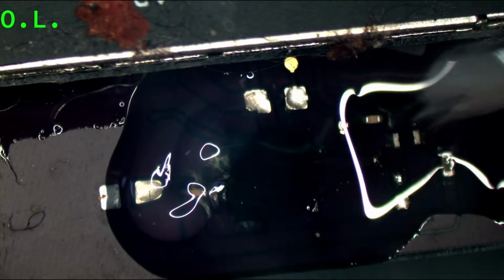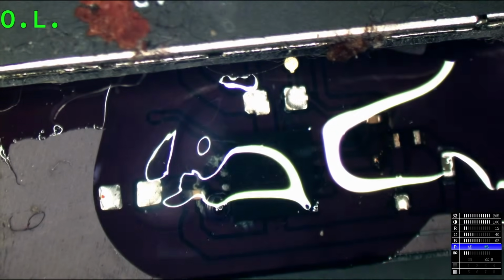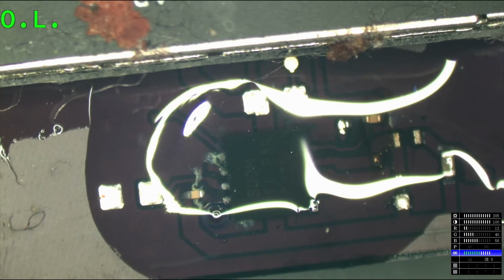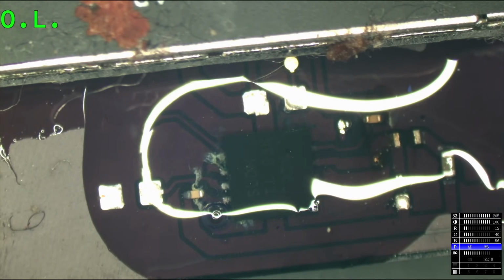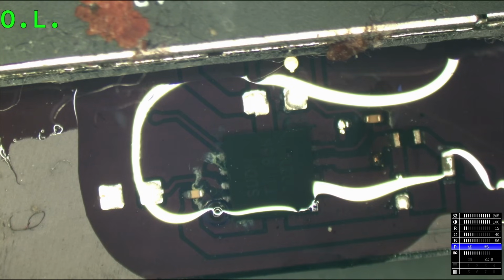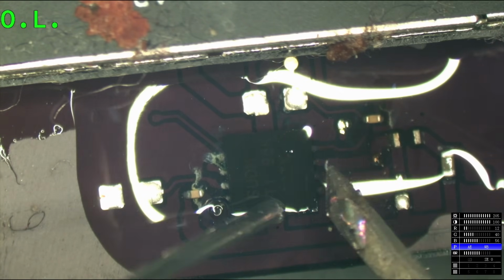This is how you learn. There are all these areas that are corroded, and the way you learn what each area does is the computer comes in with X problem and it's corroded in Y spot. Then you realize that corrosion in this spot means you don't have Wi-Fi, or corrosion in this spot means it'll be taking 20 milliamps instead of 500 in the power supply.